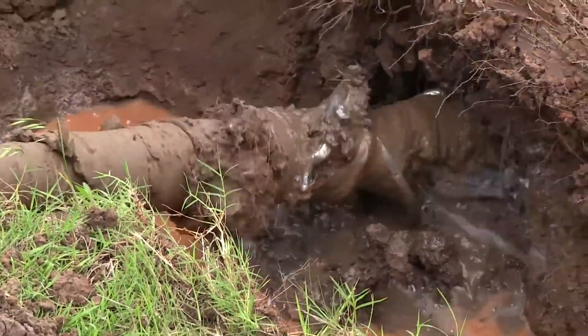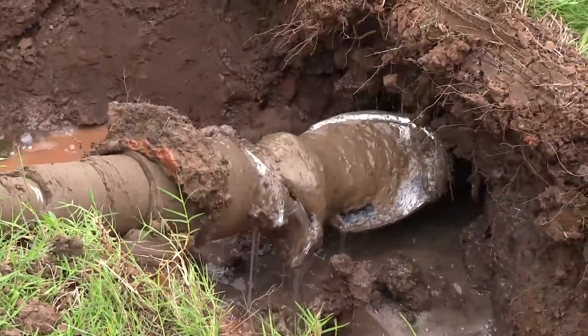Obviously, as with everything in the drilling industry, there's more than one factor that can play into this. How sticky is this clay or shale that you're drilling? Does it swell up? How much pump do you have? What's your annular velocity? What size cuttings is the bit actually making? Is a drag bit or a tricone bit going to make a difference in what you see? Have you added any inhibitive polymers to your mud system?